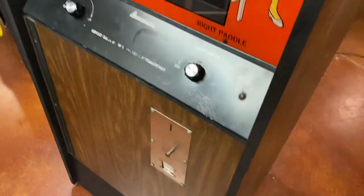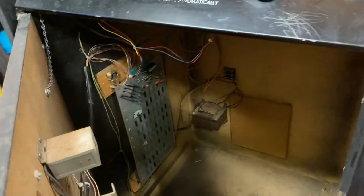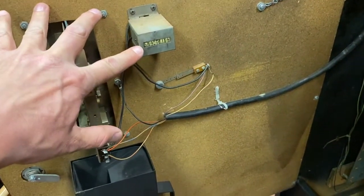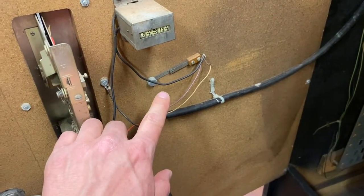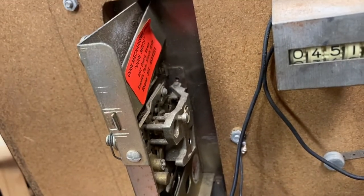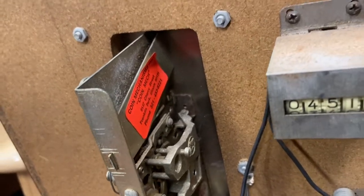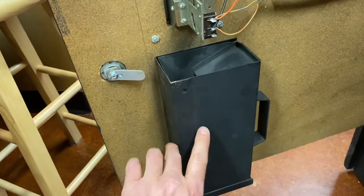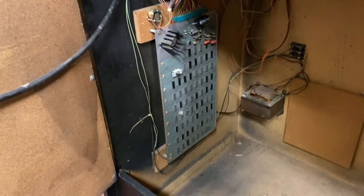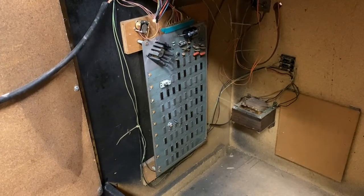We've got the roll-down coin door. I left it unlocked so I could open it up without much trouble. Inside the coin door we have a meter — 45,140 plays — and what looks like a slam switch. There's a roll-down coin mechanism. Franklin Park, Illinois. And here's the coin box — I actually have the original coin box in this, which is pretty cool. It looks like it could have had a lock in it at some point. There's my baggie of parts I replaced. We got the Pong clone board, which is, I believe, chip-for-chip an exact copy of Pong, so troubleshooting is pretty easy to figure out.